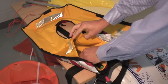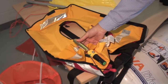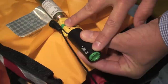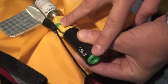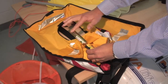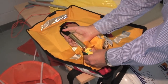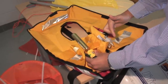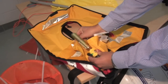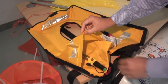I'll always want to know how my life jacket inflates. Make sure you know exactly what type of firing system you have, making sure that the indicators are green if they've got indicators on them, and that the bottle is the right size and weight for the actual life jacket, and that it's done up tight. I can feel this — this is done up nice and tight. There are no corrosion marks around the bottle, and therefore it shouldn't rub when the bottle goes back in.